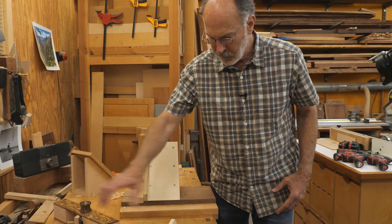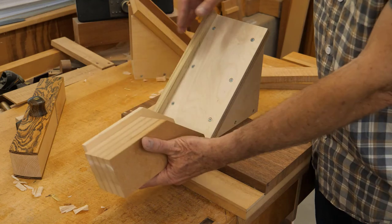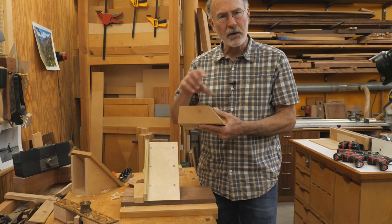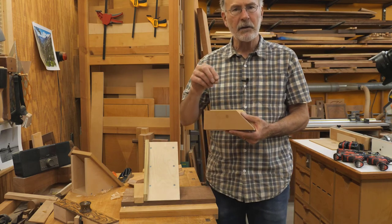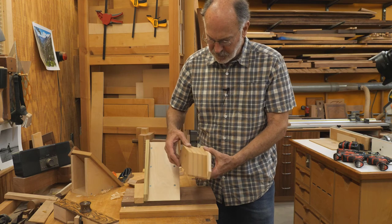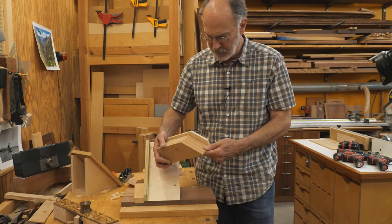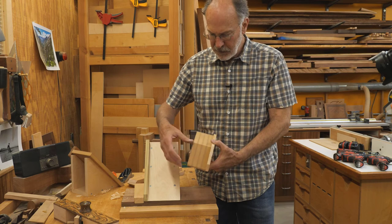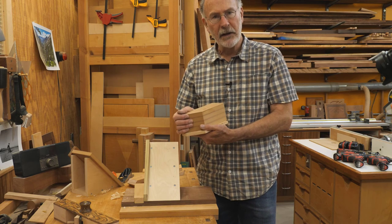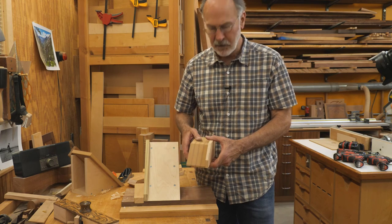One other thing to mention: this is another little donkey's ear that I've used — obviously a right-handed version, and it's for smaller stuff. I've used this for little parts when you're making small drawers or compartments for drawers. I've only used it once or twice — I should probably make a hole so I can attach it to the shooting board. The nice thing about this one is it's just four pieces of MDF glued together, and it's small enough that I can tweak it on my disk sander, whereas the larger one is too big for that machine. This works nicely for smaller items.